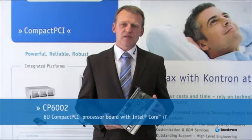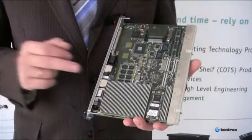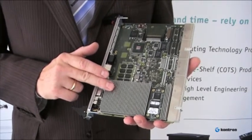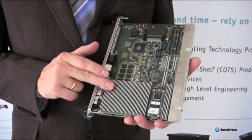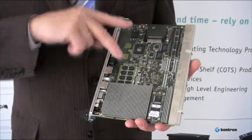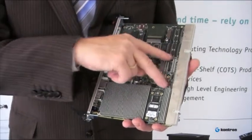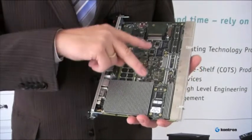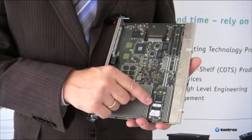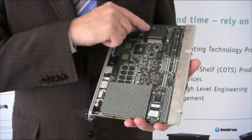Its expected lifetime is 7 years and it comes in 3 different versions. The R1 version has a Core i7 processor at 2.5 GHz, with Turbo mode at 3.2 GHz. It features a single PMC XMC slot, though another version with two slots is available. On this board there is storage capacity for a hard disk or SSD. We also offer our own SSD flash drive up to 32 GB and a compact flash socket.